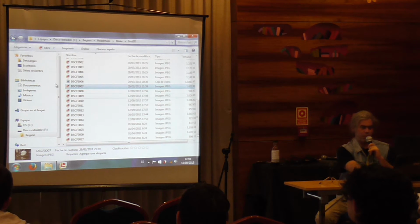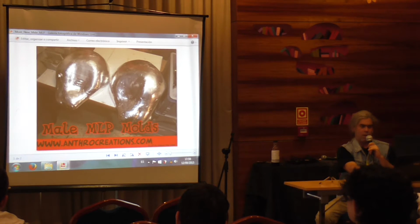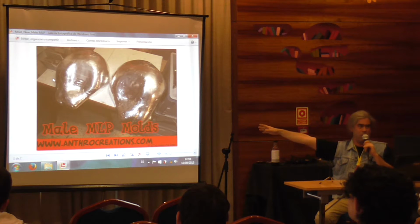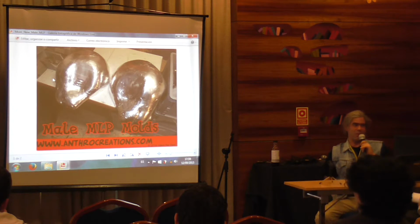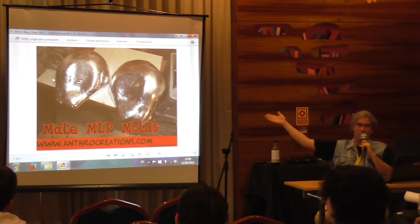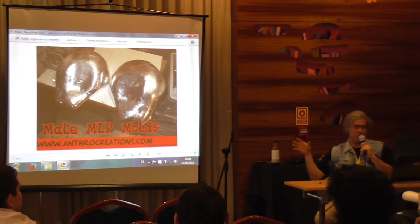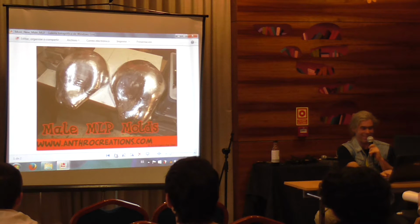I have a couple more pictures for you. That's basically the mold for the vacuum forming, cut in half. What I showed before with the resin, that's the result at the end. I covered that with aluminium because it goes into the hot vacuum forming chamber. And aluminium reflects the heat a bit, because we're still using insulation foam and you get more than 200 degrees, it melts. With that, you have about 10 seconds to take it out and demold and start again. So that's a small trick that I'm using here. We're using this cheap material to make a mold. Looks like an alien head or something in that case.